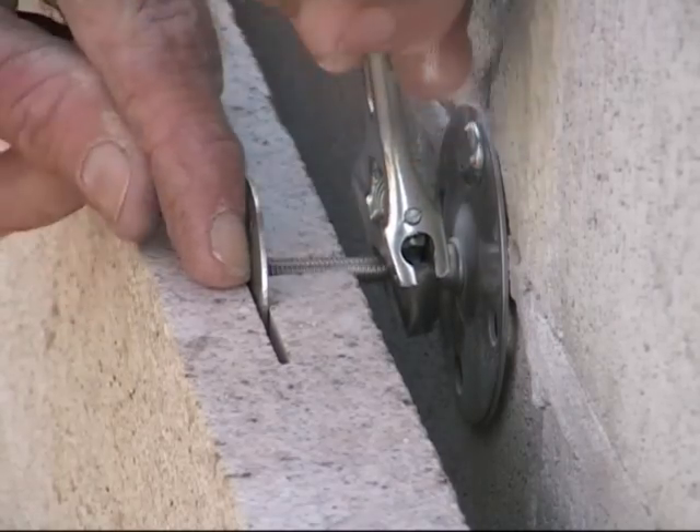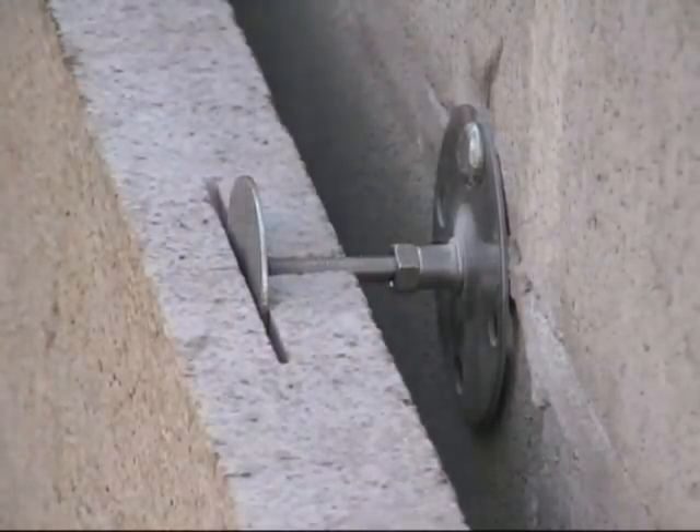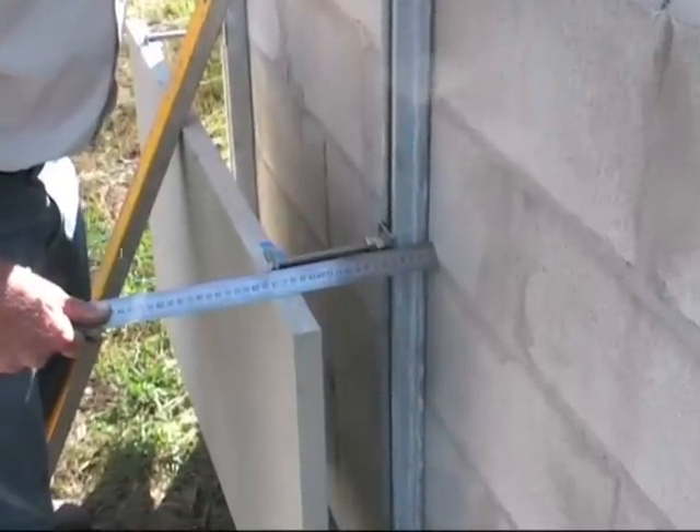But as always, you can't certify the ability of the installer. To keep moisture out of and from freezing in the cut, it is best to insert a bit of silicone into the joint before installing the stone clip.